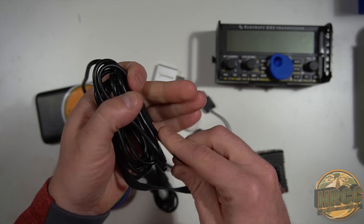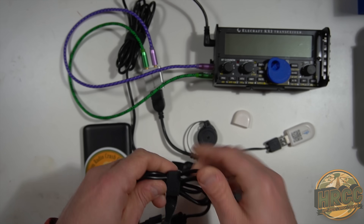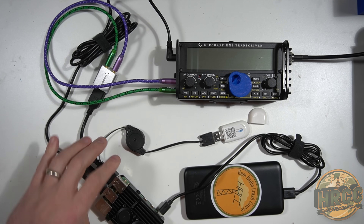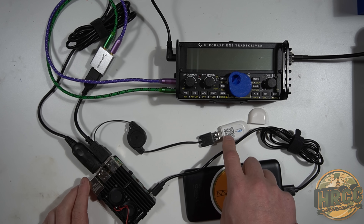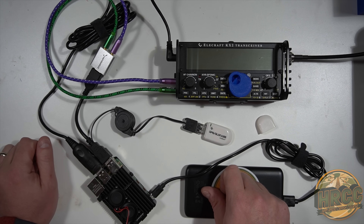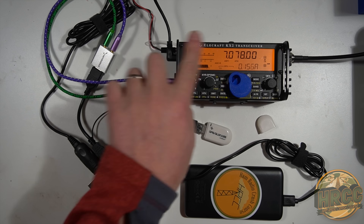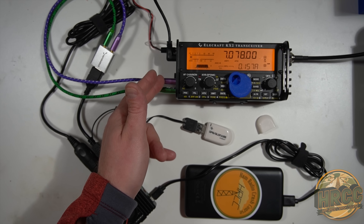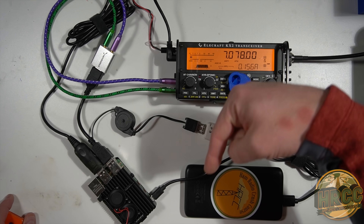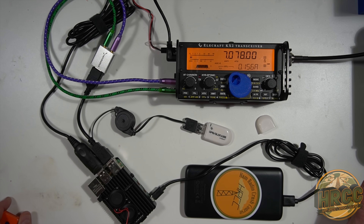And this is what it looks like all set up — feed the whole thing with whichever antenna you'd like. Now you've got the Raspberry Pi running. It will identify and pick up all connected devices: the USB connection for the radio, the sound card, and the GPS. The downside with the KX2 is that you won't hear the speaker while working digital mode — it can't output audio to both the digital interface and the internal speaker simultaneously. But honestly, I haven't had a problem with it because I just have the audio displayed in WSJTX or whichever digital mode I'm using, and it's fine.